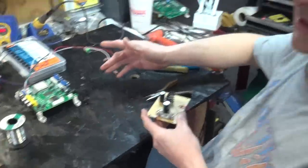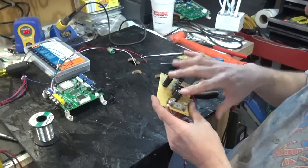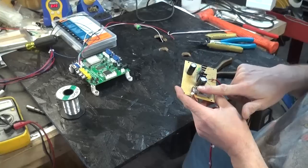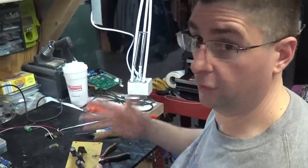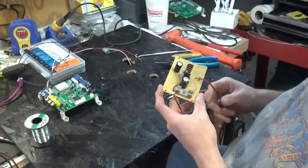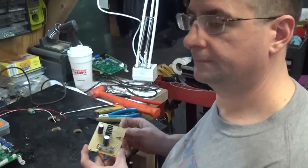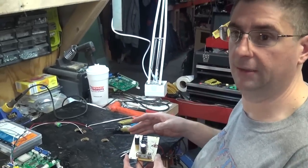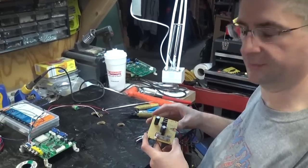The Dell monitors have a 12-volt output to power speakers, so what we're going to do is tap off of that for the 5-volt regulator, some filter caps, a power indicator LED, and we're going to fuse it just for safety — putting a screw terminal or a big power supply would be overkill, so this should work. That's because there's no 5-volt power supply in a Mooncresta. This game has 5 volts regulated on the board like a Pac-Man, so I don't want to take any voltages off the board — it's so old it just doesn't make sense to do that.